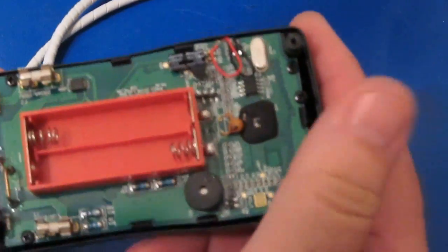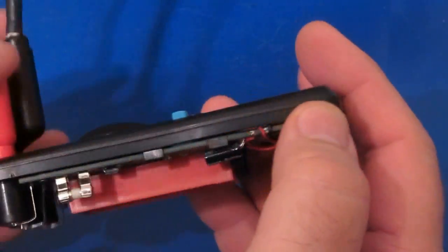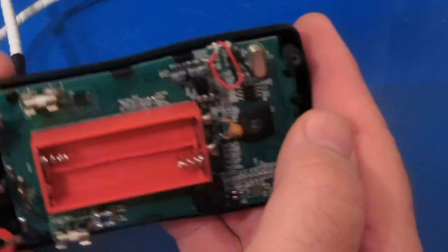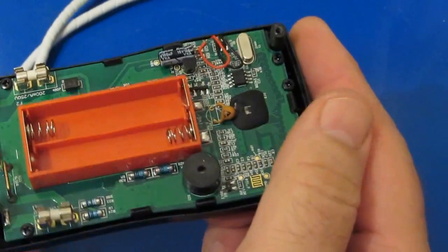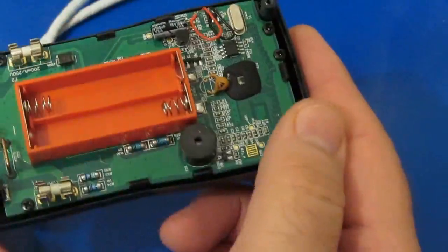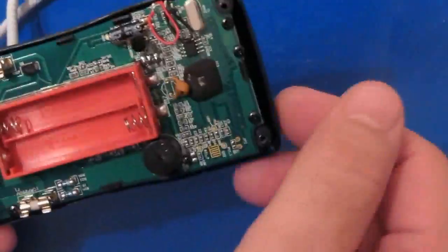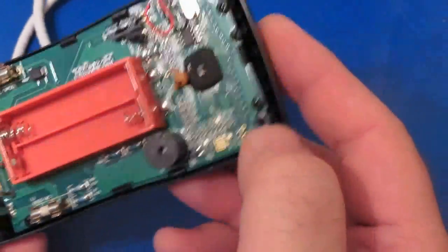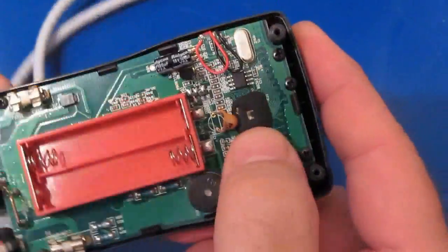So just for comparison, when Dave was showing the insulation tester being used to check the meters, again a very crude setup, I think those insulation testers are somewhere sub 2 milliamps. We are applying basically a 2,500 volt transient, less than what he's got, but we're limited to the 2 ohm source impedance, so we're putting out about 1200 amps initially when this thing hits. And this is at about 20 joules max that we can deliver with this particular transient generator. So a fair amount more energy than what he's able to get out of that insulation tester, and that's why you see the damage that you do.